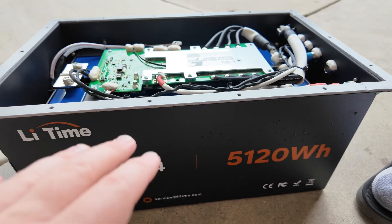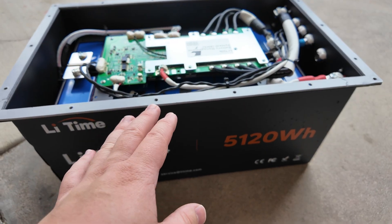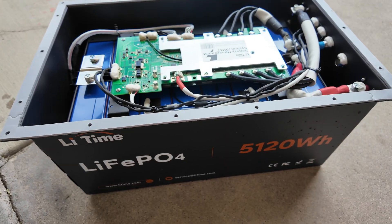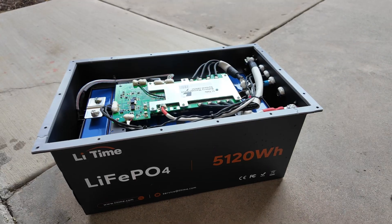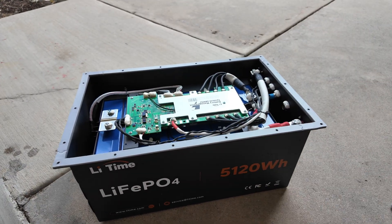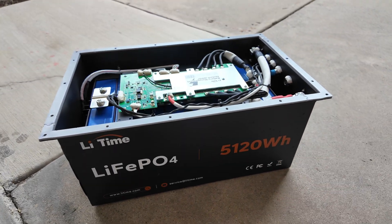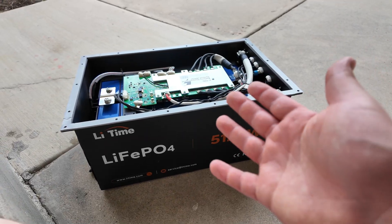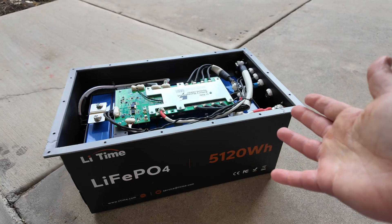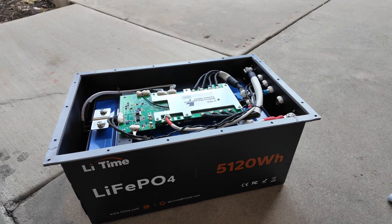One of these golf cart batteries in a steel enclosure is going to be more expensive than the same kind in a plastic enclosure, but the benefit is better water resistance and stronger durability. You also get the peace of mind of having your batteries inside a completely non-combustible, non-meltable case. I can't tell you how many times I've seen people's power stations and batteries get ruined during hurricane season because water got in — this might be your saving grace. It should give you more peace of mind than a wall mount or server rack battery with no IP rating whatsoever. IP66 is pretty darn close to perfect; it's just not rated for full submersion, but I wouldn't be surprised if this could survive being submerged briefly. It has a way better chance of surviving and continuing to serve you even if it gets flooded than any other battery option out there.